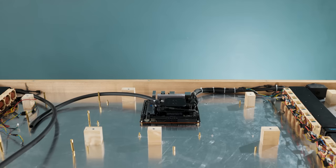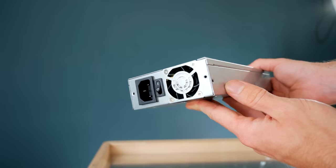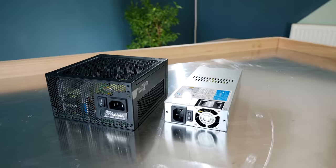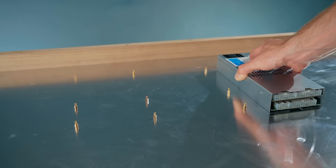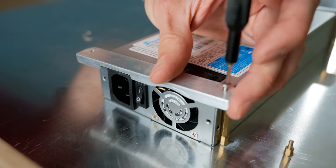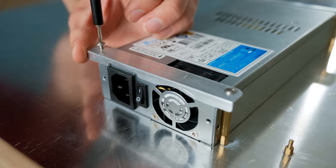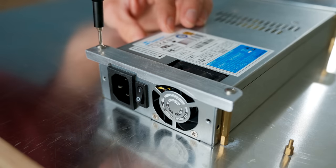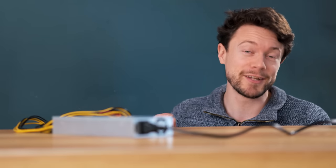So this is looking great, but before moving on we need to focus on the power supply. The original power supply I used was a thin 1U power supply, rather than the traditional ATX variety for obvious reasons. While it worked well overall, it was a model that was geared very much towards industrial applications, and as a result absolute silent operation was not a primary design consideration. This means that while it is pretty quiet overall as the fan only spins at very high load levels, it does emit transformer whine at all times. For an absolutely silent build, this is definitely something I would rather avoid, but there are very few alternative power supplies thin enough to fit inside the PC — unless one thinks outside the box.